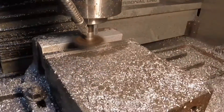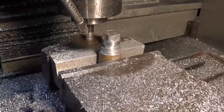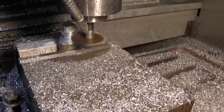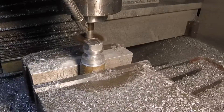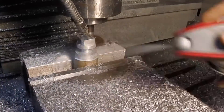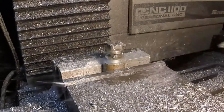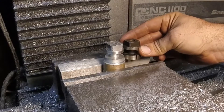Here it is finishing up. Now we're going to take a cut on the relieved area — I don't even know what to call it. This is a 2-inch T-slot cutter or keyway cutter: 3000 RPM at 15 inches a minute. I've found more uses for this cutter than I can think of. There's our finish pass, and now we're going to spot drill and then drill all the way through — 9/32 inches is the hole size I needed.